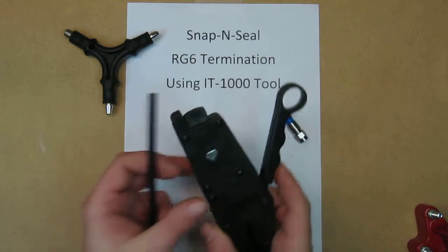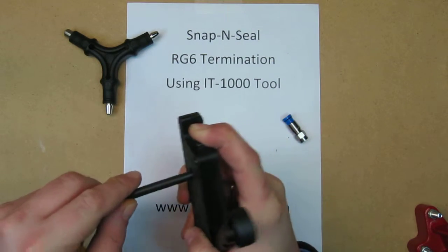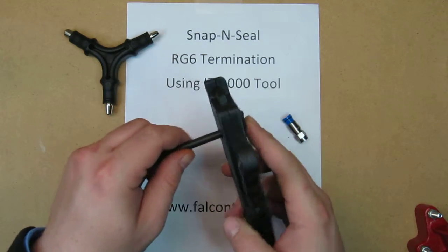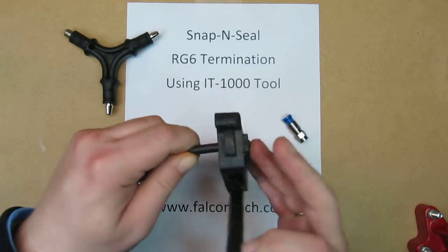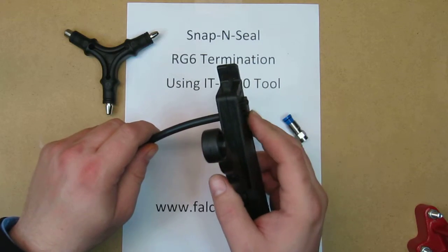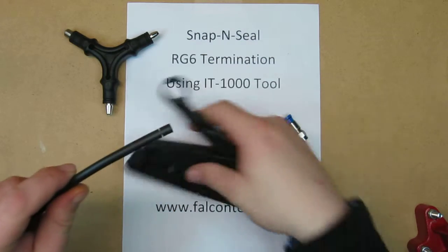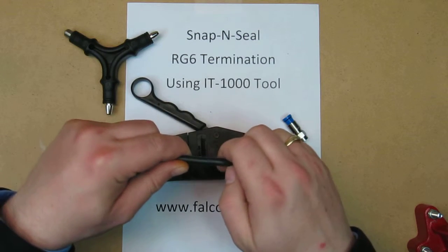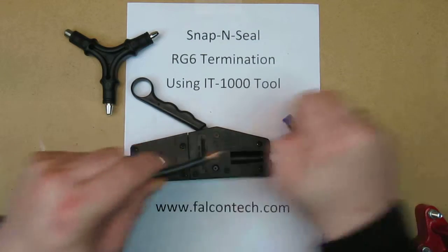First you're going to start off and you're going to actually push the wire stripper down and put your cable in. And it's got a wire stop in the back so you know how far to put it in. You let go of the spring, give it about 3 turns, and this is where you don't just pull the wire out, because it'll leave all the insulation in the tool. Go ahead and compress that, then pull it out. Otherwise you'll be digging this insulation out of there for about 15 minutes. Go ahead and remove all the insulation.